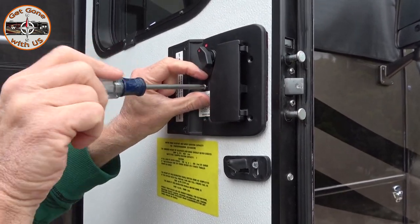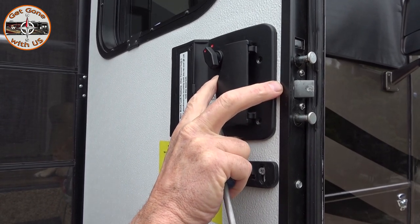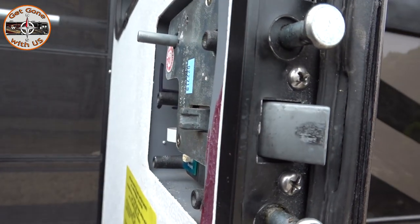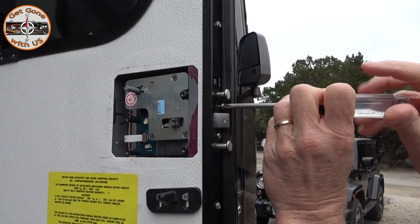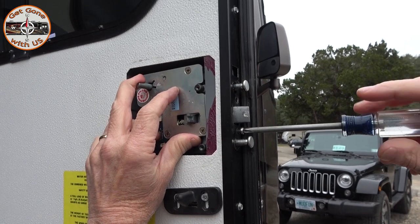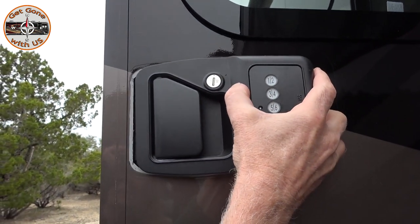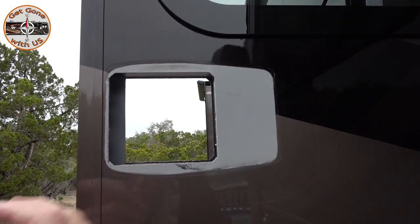You're gonna have to get the last screw out. When you take this last one out, if you already have this kind in here, you want to be careful because there is a wire that needs to be disconnected before you pull it down. My wires came out - I can see what the problem is; that possibly could have been part of the problem. Next, just gonna take out the door edge screws. For the last screw I'm gonna hold it because Maggie's got full body paint and we don't want to scratch the paint. When you're holding it, the screw is a lot longer than you think. Come around the other side, then just lift it out - and it's out. Look what color she is underneath - Jayco doesn't even paint the whole door before putting the lock in.